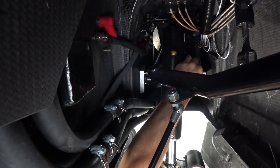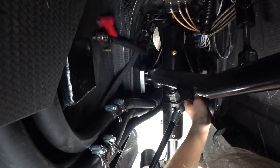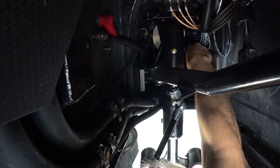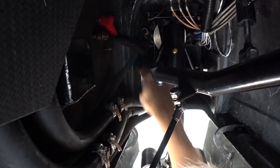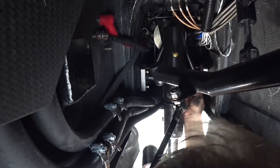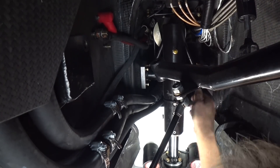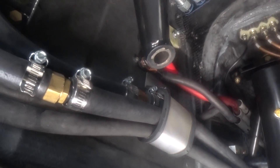I'm pretty happy with how things are working out now with the ailerons — I don't think it'll be a problem. I can always tension up a little bit more if I need to, or if Justin wants me to. It didn't take too long to get this sorted out. It's nice to be putting things back together after having the nose gear out of the aircraft while going through the different experiments trying to get the aileron cables sorted out — ultimately back to the initial solution, but with the pulleys anchored much better. You can see I've got the hose bracket back in place there.